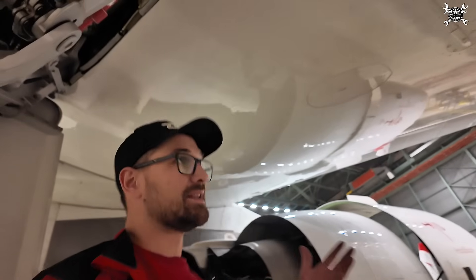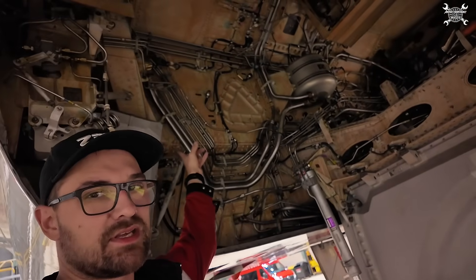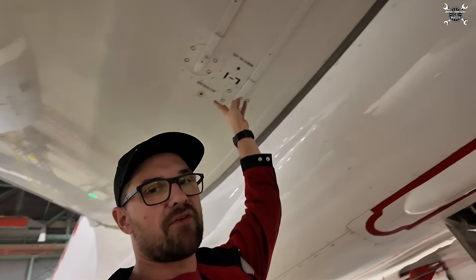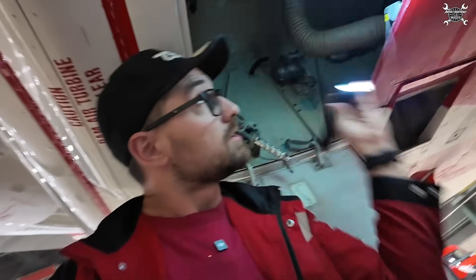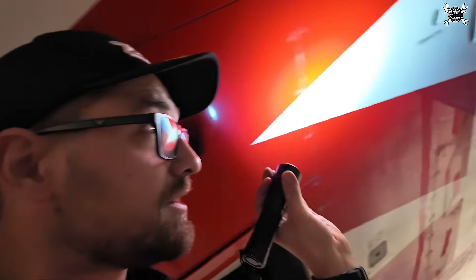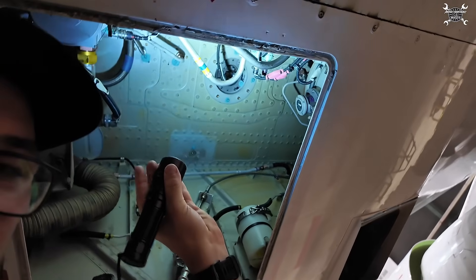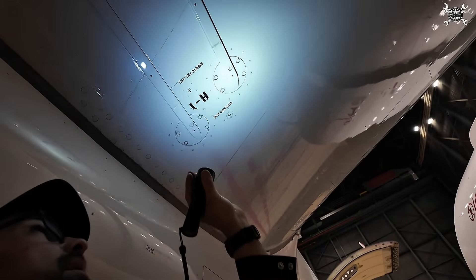First of all, let's take a look at how it works. Where is fuel stored? It is stored inside of the wings and as well in the center tank which you can see up there. From there the fuel is sucked thanks to six pumps, two for each tank. So here you have the wing tanks, up here is a center tank pump and over here we have a second one, that one with a connector.